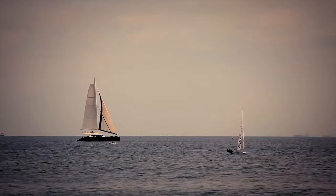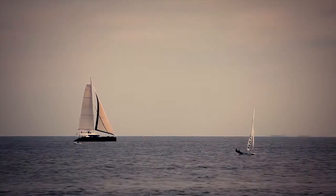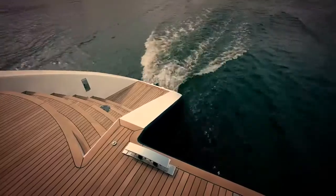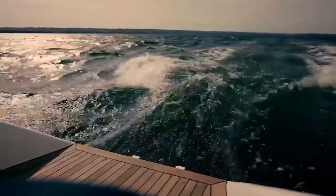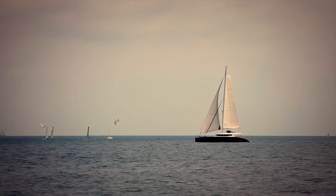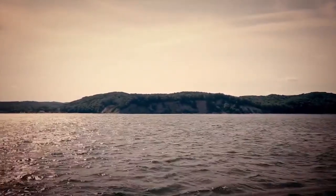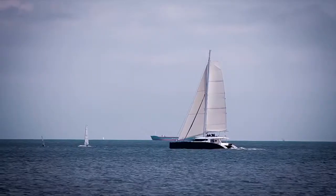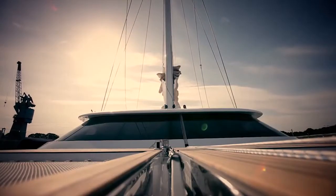We developed on the boat a system to check the load on the rig at all times. We have a very powerful rig — we put very big sails and a powerful rig. To make sure the skipper can push the boat safely without any risk, we have 12 load pins on the boat. At all times the skipper can know the load on the mast, on the stays, on the winches, and he can record the load to confirm he is sailing safely. In addition, we have a black box recording the load at all times, so we as a shipyard can download these values and verify that the design values are respected when the boat is sailing.